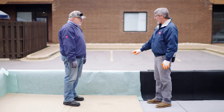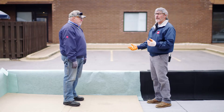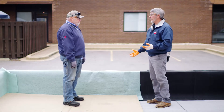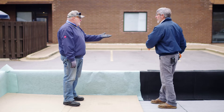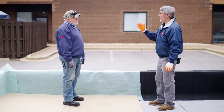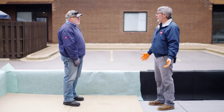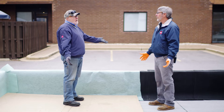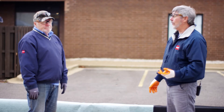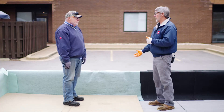Once I go to flash these walls, can I glue to that? No. So you're going to have to loose lay the walls on a typical insulation, unless you want to come in and tear all the flashings off or bury the flashings. What happens if the guy says he's just going to tear the flashings off? You still got asphalt — the residue from the asphalt. Depending on how old it is, it could even be hot mop. Then you've got a whole lot of work — you might have to re-sheet the walls. So that's another option.